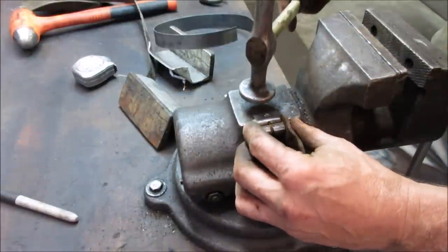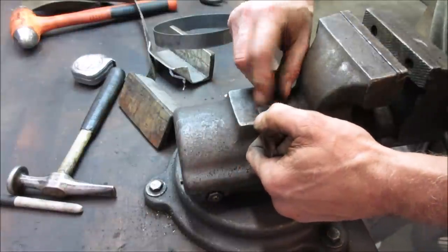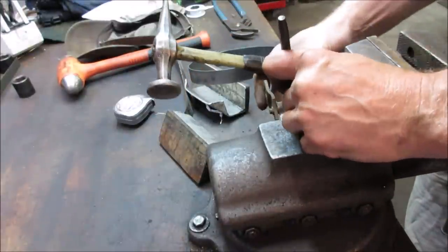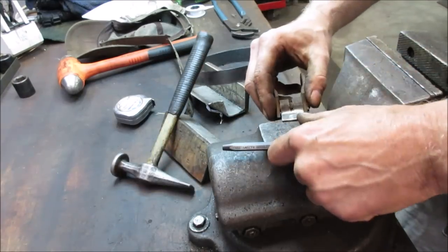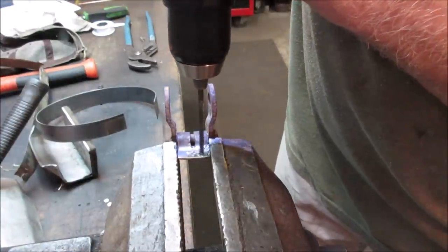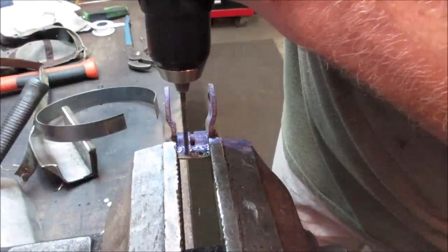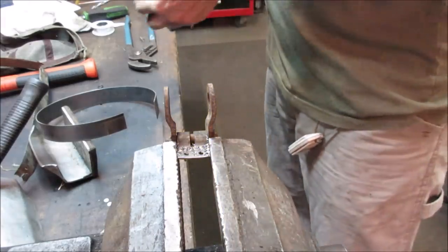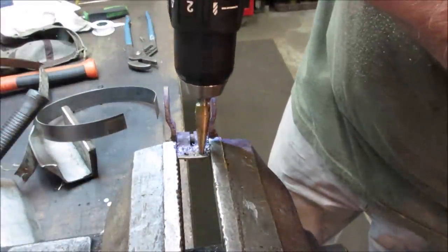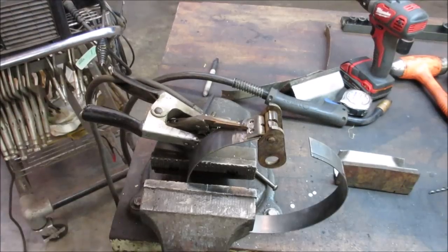See, they just had a spot weld. I can knock that down. Probably just drill two holes in it and plug weld it. And give her a couple of love zaps.